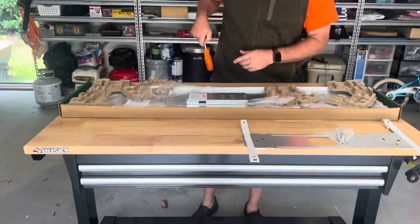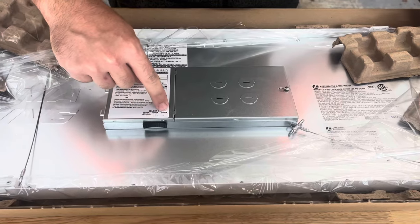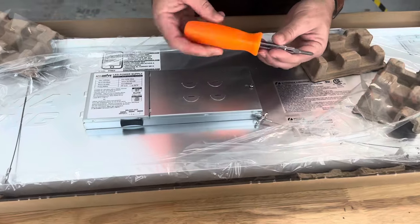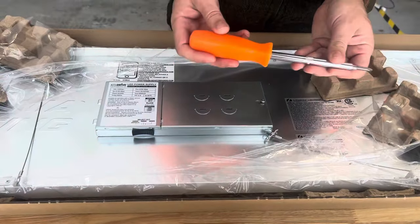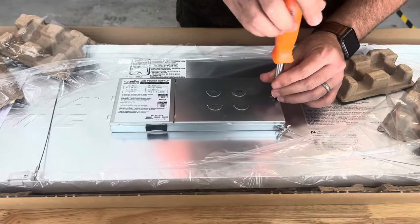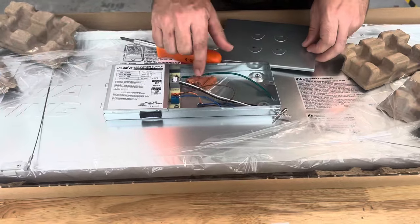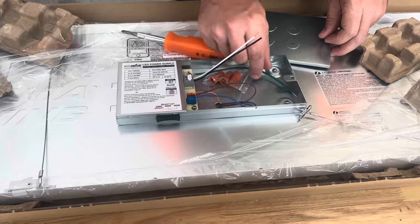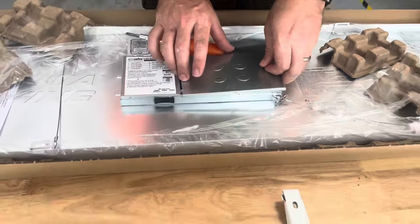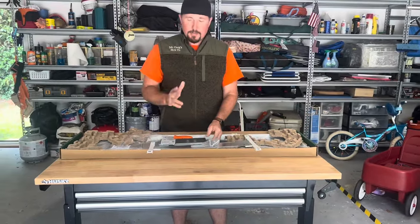Looking over here real close, you can see you can pick the different brightness settings. There's 3,500, 4,000, or 5,000. We're probably going to start with 5,000 and see how that looks, but you can pick that. Then you want to take your screwdriver — I'll link this multi-screwdriver in the description. You unscrew this, take off this cover, and here are your wire nuts. You're basically just going to have easy wiring right here. We're going to walk you through how to get the template set up so you can mount the bracket and take it step by step.